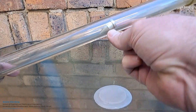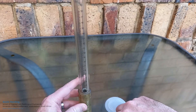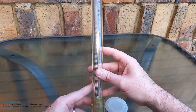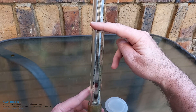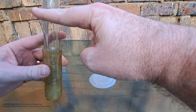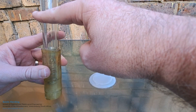So as we've said in the notes and in class, when we have this upright, water will flow through the bottom, push this float up to the top, and then depending on where the force is balanced, we will then read off the marking — wherever this might be. So say the top is over there, we'll read the mark off there, and that's as simple as it gets.